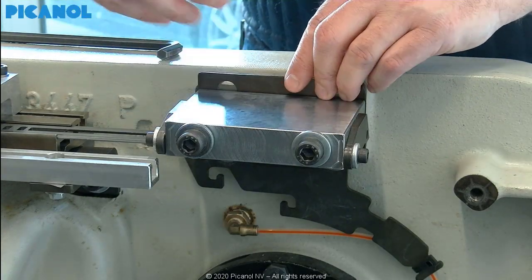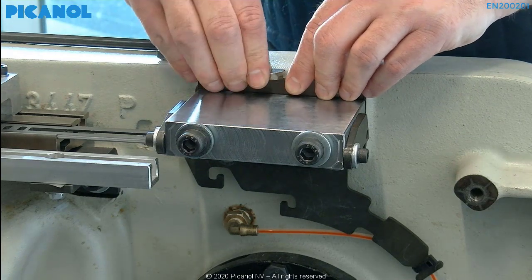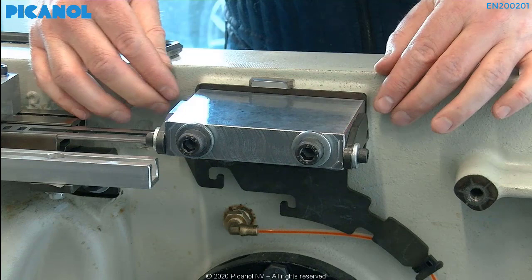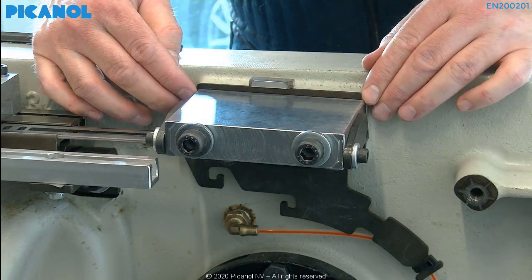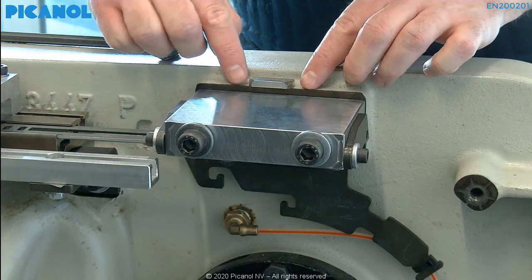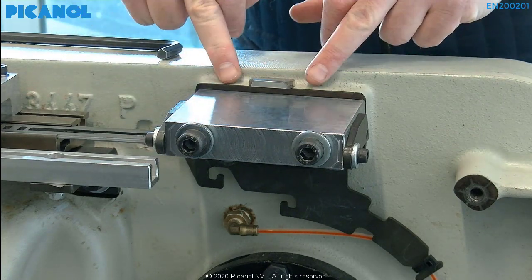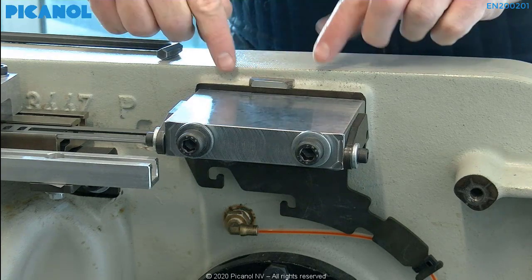You can use this tip and trick to make sure that your thickness plates are placed correctly. Use a strong magnet to pull the thickness plates up — we don't want the plates to drop down completely, so we are able to set the oil guides against the cooling blocks later. We can use these oil guides as a reference point if we change the rapier wheel.